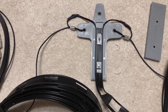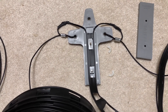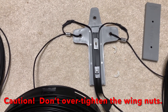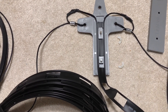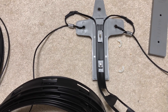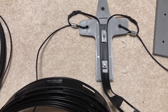What I recommend everyone to do if you get one of these antennas — or if you use a ladder lock for any antenna — is after you put the cover on and tighten the wing nuts, put a bead of silicone around it, just smear it with your finger enough to stop any moisture from getting in there. That's what I did to mine — just a little bit of clear silicone let go around the cracks where the top piece joins the bottom piece.